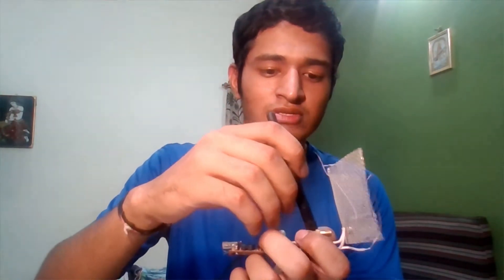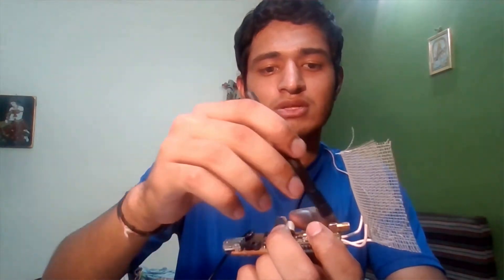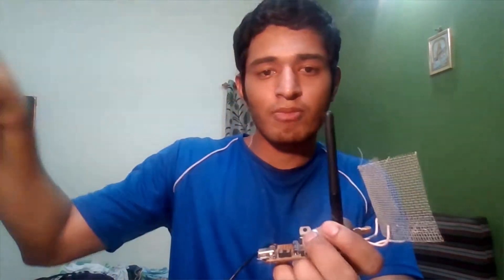In my previous video I made a voice transmission device — this is the receiver and this one is the transmitter. The receiver I left the same. This is an omnidirectional antenna, which tends to send signals in a cylindrical shape in all directions. Previously with my transmitter setup I was getting something around 380 to 400 meters of distance.